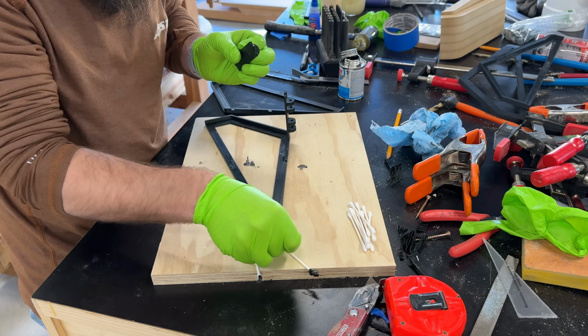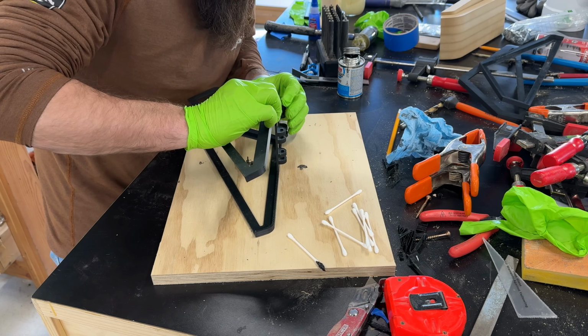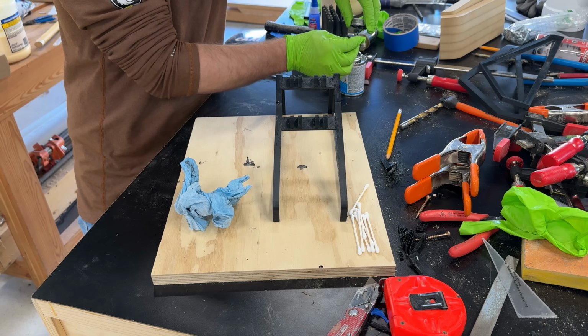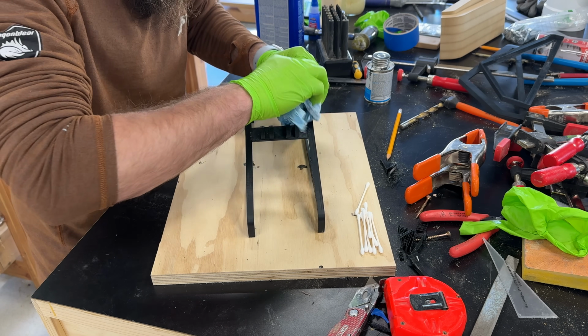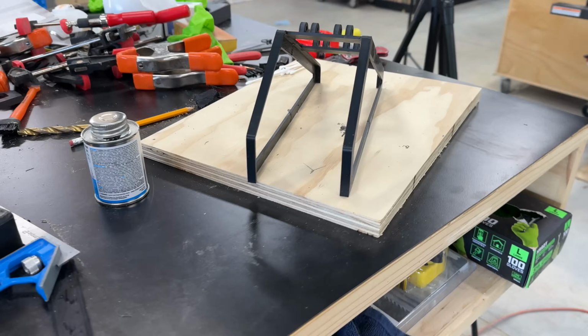All of the printed components are made from ASA filament, and I've really grown to like this material due to its strength and the post-process finishing options. It's closely related to ABS and allows me to assemble it with ABS cement, which ultimately welds the pieces together. Another cool thing is it can be joined together using a product called Weld-on-4, which will be important when I get to installing the polycarbonate faces.